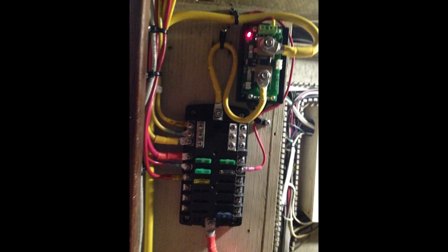This is my fuse block for all the incoming forms of power generation — be that solar panel, wind turbine, or water turbine. One of the things I wanted to do was determine how many amps at any given time are being produced, so in order to do that I needed to install a simple shunt, which you see here.